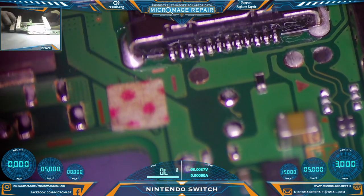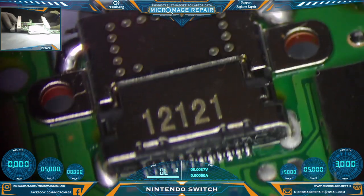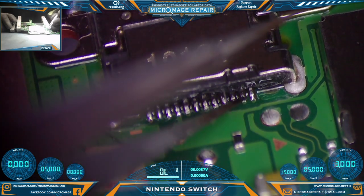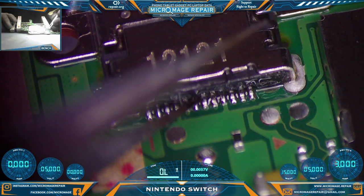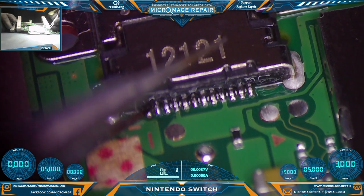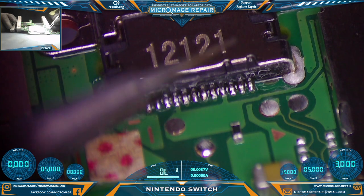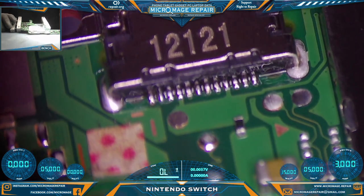Okay, reasonably good feed through. Let's check these other pins, the front pins. When you're concentrating on the center row, sometimes you can not do a good job of soldering the front row. The center row is the more important part, because you can always touch these up later. But it looks like we got them real good.